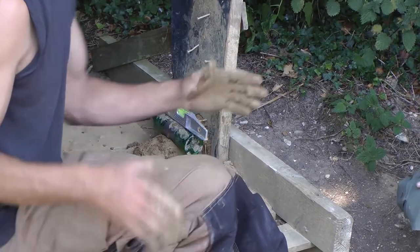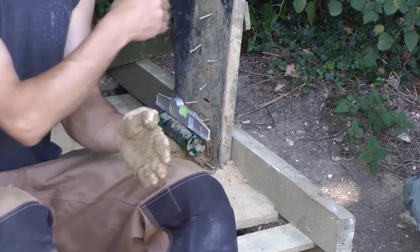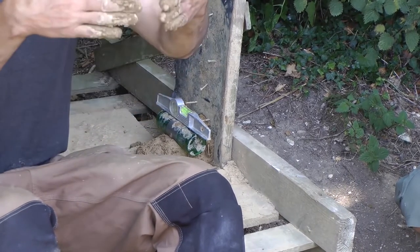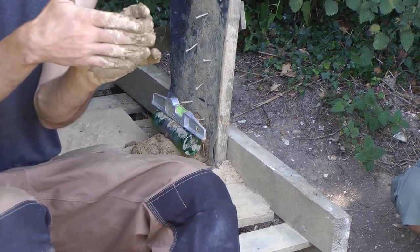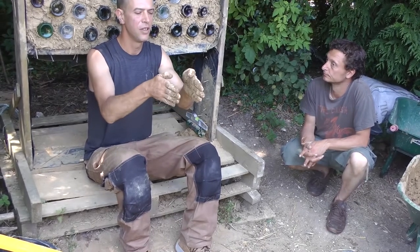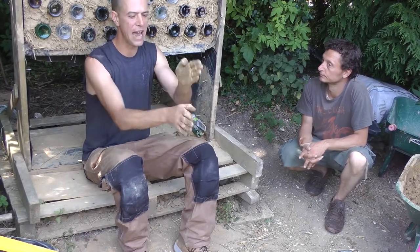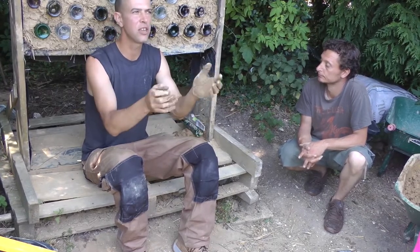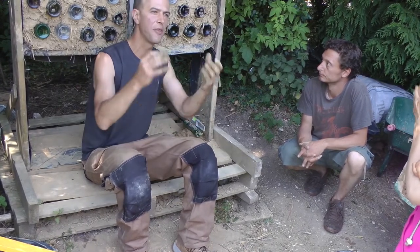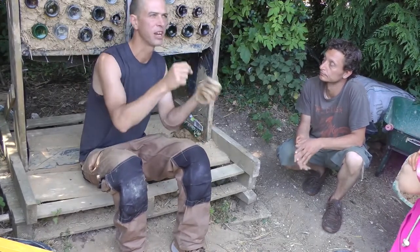Now the importance of that is, imagine if I didn't do this check side to side, making sure it's parallel to the edge or the bottle next to it. Then it might be like this and the next bottle like this. So I've made my 1 inch there, but look in the back, it's like 6 inches. So also checking this way: if it's not level, then it could be tilted this way or that. And the mortar joint in the front will be 1 inch, but in the back you might have two bottles touching. So you need to do these three checks, and that's how you do it. And then your wall will have the mirror image front and back. So you don't need to keep running around back and forth measuring.